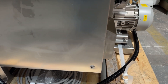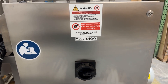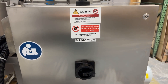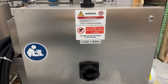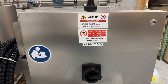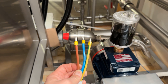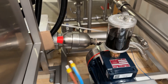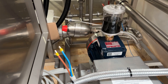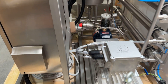This particular system is 230 volts, single phase, 60 hertz. We can also do 230 three phase, or 400-and-change three phase — as long as you tell us in advance we can get that accomplished for you. This particular system is mono phase so you can see there are only three wires. Depending on your installation, this is basically what your electrician has to deal with — connecting this to your power supply — and that will depend on the system that you configure.